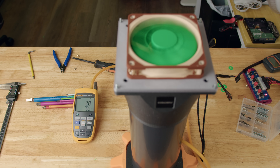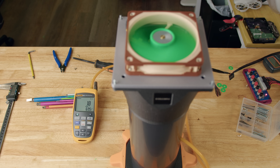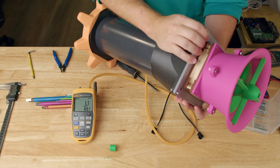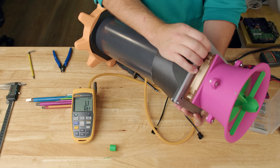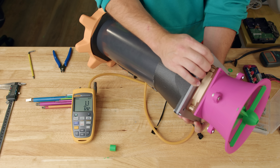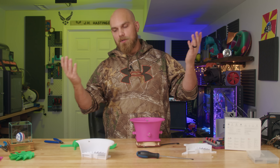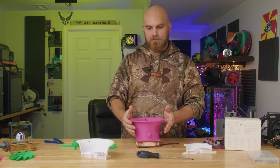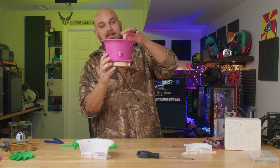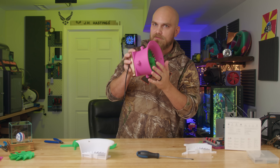In the static pressure test, the Hybrid came in at 2.8 millimeters of H2O, the Grain Dryer came in at 2.7, the Involute came in at 1.8, and the Olympus came in at 1.2 — kind of. I say kind of because I had to hold the test stand at a specific angle to keep things from rubbing. When the fan was just sitting on top like I test every other fan, it only produced about 0.9, mostly due to too much rubbing. Based on the clearances in this fan, it just rubs too bad when sitting flat. But with the bearing support on the front, there is an angle where everything just kind of spins freely.